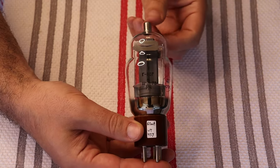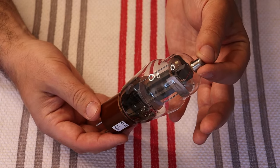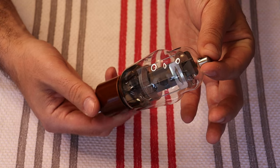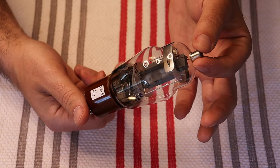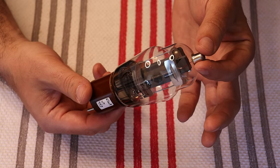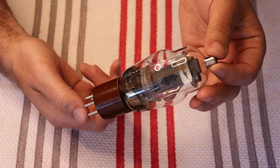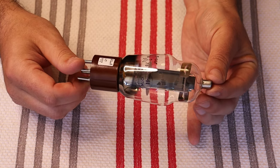These caught our interest. They're absolutely beautifully made tubes. They're very similar in construction to the North American equivalents, because the Soviet Union got a lot of material supply and support for World War II, and these are the transmitting tubes that would have been in use at that time. If you look at a vintage RCA 807, it's almost identical — some minor differences in the plate and construction, but you can clearly tell they're related. This was a power tube used by home developers in the 1950s and 60s looking for something available, affordable, and high powered.